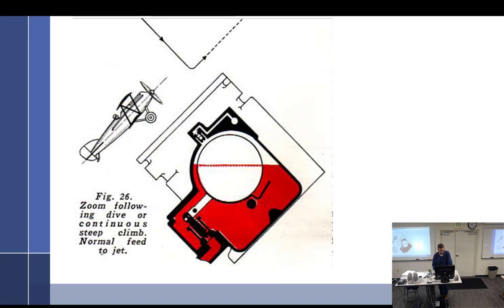And then somebody once said this, that carburetors are also set up so that, and I actually found a picture of this. I thought, oh, that's awesome, because I was taught this a long, long time ago. Like your Stromberg has no economizer system, but yet when you start to climb, it's put together in such a way, and you'll have to look at this and verify it, that where the fuel was normally at this level, the distance of the fuel on top of the needle, which would represent then the fuel on top of the main discharge nozzle, was this much. But then when you go into a climb, because of the angle of the carburetor, the head pressure, if you will, this puts this down lower, that's more pressure, allows a little bit extra rich mixture while you're climbing. I don't know how true that is, but I did find a picture that showed it. Still don't know if it's true.